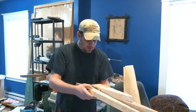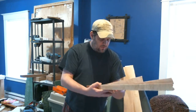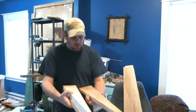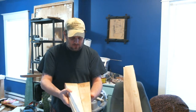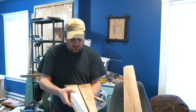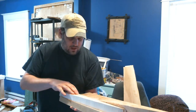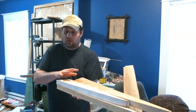They suggested to glue it on both sides. I just put the epoxy on both pieces and then do the joining. On this piece, I don't think I really hit it very much at all — I was able to pull it apart with a fair bit of force. On this piece, I did it fully, and you can see here where it actually pulled the wood off of this board. It's stuck on this side here with a lighter color. But on this one, it didn't connect in all places. If I had buttered it on both sides, it probably would have connected in all spots and held a lot better.